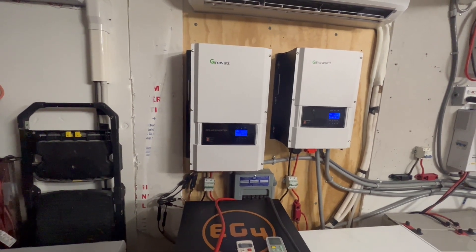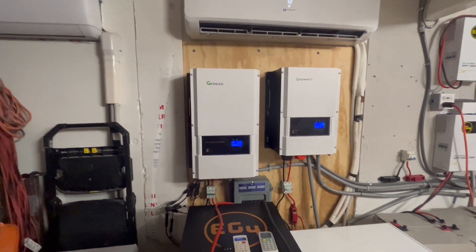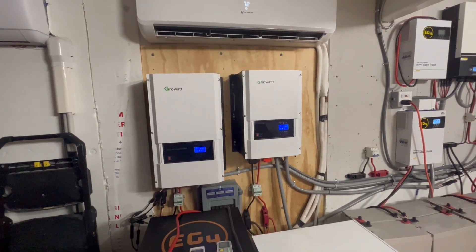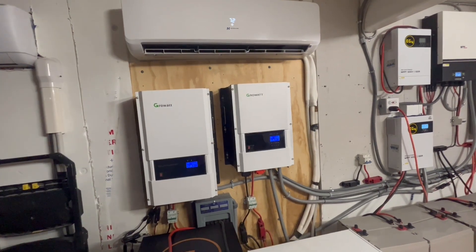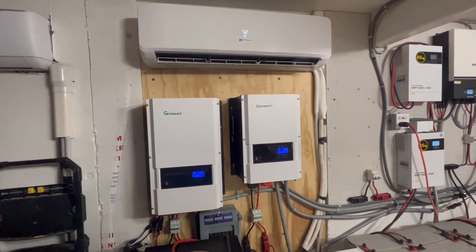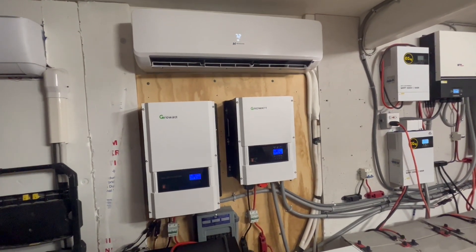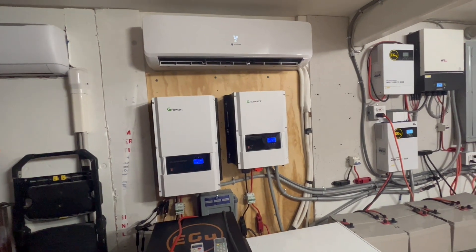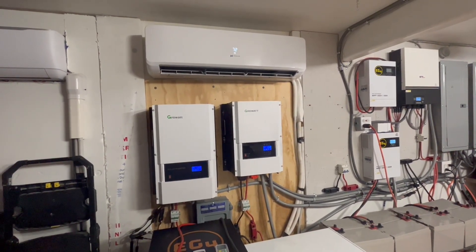It's really nice being able to keep our house cool like this. If you wanted to run your house warmer at 75 to 76 instead of 68 to 70 during the day you could do that too — I set it lower because it super-cools the upstairs and keeps the air conditioner from kicking on so often. At night the 3.5 ton upstairs only kicks on for about 3 to 4 minutes and then doesn't kick on again for another 15 to 20 minutes. Please like, share, subscribe, hit that notification bell, and I hope you have a truly wonderful and blessed day!